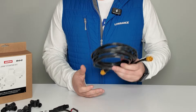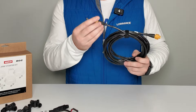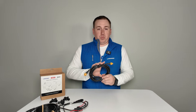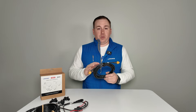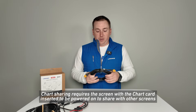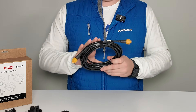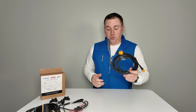Ethernet is kind of our high data bandwidth messaging system. This is our Ethernet connector here with the yellow connector on the end — quick twist lock waterproof connectors. This is how you'll get your Active Target picture from your module to your display, how you'll share a CMAP chart card between two displays, how you plug in radars, and how you keep a live running database of all your waypoints between Lowrance displays.